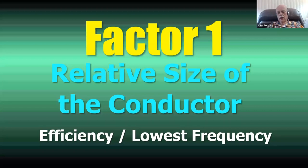Number one, and believe me, it actually is the number one factor. It is the one factor where most loop builders fail, and I include in this most of the commercial mag loop builders. They fail most often in this one factor alone. You can probably forget all the other factors, and if you get this one right, you're probably going to get closest to the optimized loop. Now, this factor number one is the most important: relative size of the conductor.